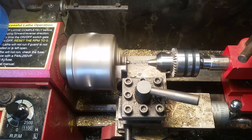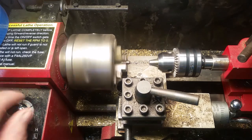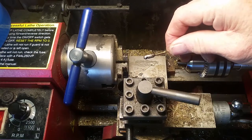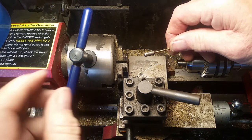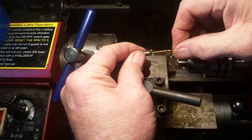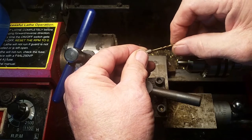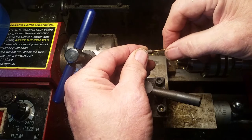There's four marks. I'll take this out now. Here's the firing pin out of the lathe with the drill bit shank inserted in it. I'll clean this up a little bit, clean the oil out of it, and then use Loctite to fasten it in, then cut it off again like I did the other one.